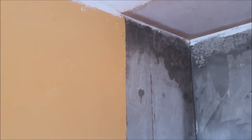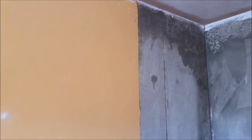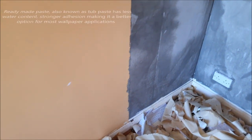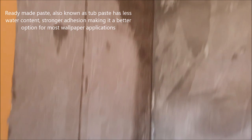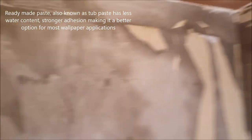As you can see, I've been round and soaked it with the garden sprayer. It only took one good soak - it depends on how well the paper was stuck in the first place. Not very good on this occasion. I presume it was flake paste, so it's weaker - less strong wallpaper adhesive with more water content, meaning less glue, so it's just not as strong generally. Pretty easy to get the backing paper off - one soak all around the room, and by the time you've gone round, it's time to start stripping so it comes off nice and easy.